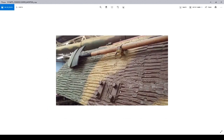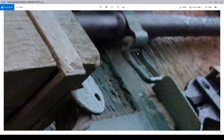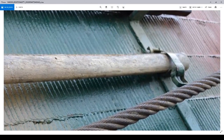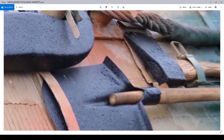Here's a smaller Type 1 on the Bovington Jagdtiger. Here's a restored Panther — as you can see it has Type 2s. Panthers have all Type 2 clamps. But this handle is the flat original type and this one looks to be the round one with the flat inside — so this one's probably original and I'm not sure if this one is. This is interesting — I've never quite seen this before even though it's in my own reference folder. This is a midsize Type 1 which I've never seen on Panther, so I'm not sure if that's supposed to be there — it could be a restoration thing. Here's a standard, kind of deeper than the ones I showed you, Type 2 — I've seen these for sale but I don't have one. Just like the W one I showed you but a little bit taller.